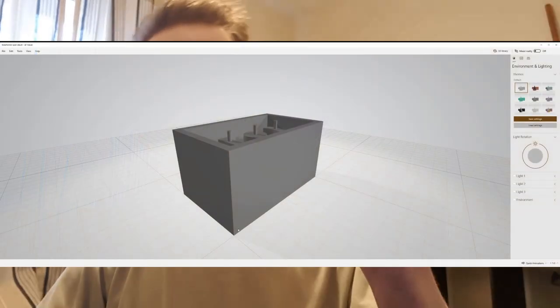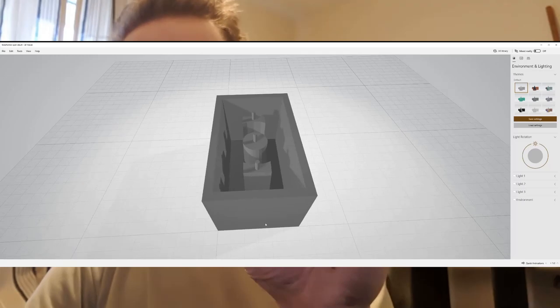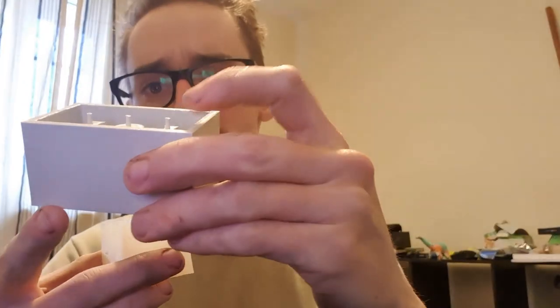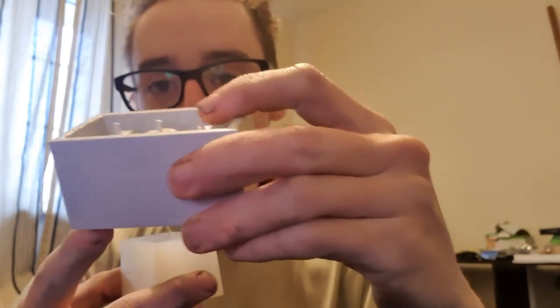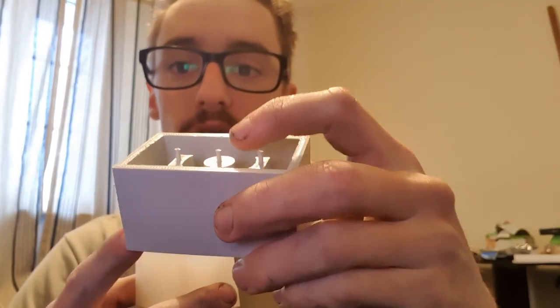So in order to make these parts, the first thing you'll want to make is a die. I 3D printed this, but you can make it however you want. The one important thing to note for your die is that it should have tapered edges, so that your silicone mold can be released more easily. I also put these drainage holes here so that any acetone could drain out the bottom, but that didn't really seem to do anything, so maybe in the future I won't include those.